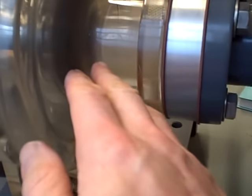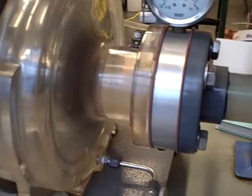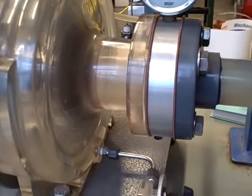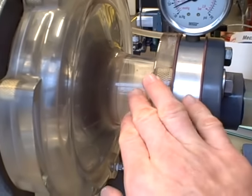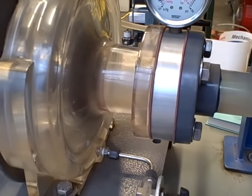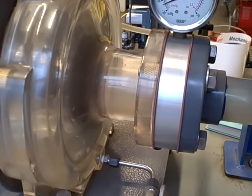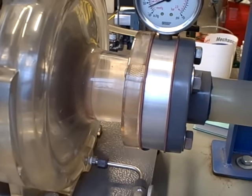We can see it happening here. We can also see some bubbles here at the scroll casing of the pump. Cavitation is very destructive, especially upon metal surfaces. The acrylic surfaces here seem to handle it a little bit better, but with metal surfaces it's not forgiving — that's very destructive. The metal will become pitted by the high pressure jets formed by the collapsing bubbles.